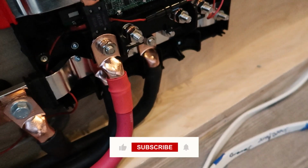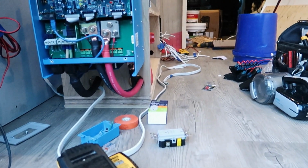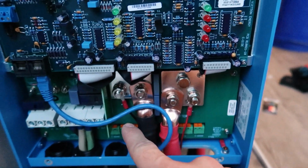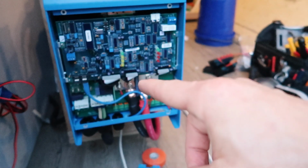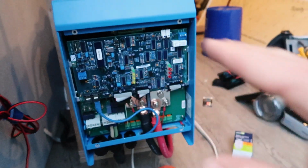The middle black wire is for the ground, so that comes up underneath and mounts right up in here behind the Multiplus. This big wire is the 30 amp shore power coming off so you can charge your van. Bam, the inlet, I haven't wired it yet. This little positive wire and that little negative wire run the smart Bluetooth dongle for the Multiplus, and then it runs to this little Ethernet looking cord up into the Multiplus. So that's giving you all your readings.